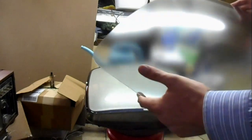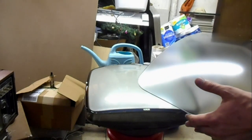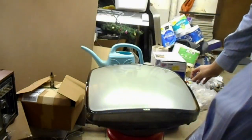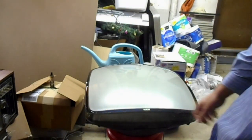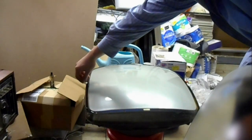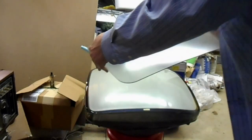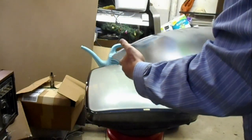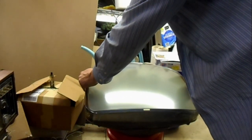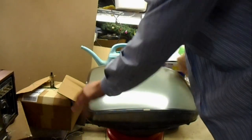I've found CRTs that have frost and tint generally tend to have a certain amount of non-removable haze to the surface of the CRT face, and the frosted and tinted safety glass tends to hide that. The PVA also would help to optically smooth that out, but we are not putting PVA back between the glass. I've laid down four double stack strips of foam double stick tape that will act as spacers and positioners. I've got the CRT face and the inside of the safety glass as clean as I believe I can get them. I'm going to just line this up and press down once I feel like the alignment is good, and it feels pretty good.